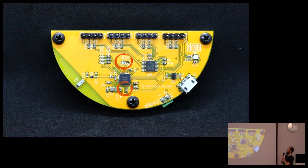I was very confused, and it took me a long time to figure it out, but basically, this microcontroller has an option to have a built-in DC-DC converter for power. So when it does Bluetooth transmission, they can usually lower the power consumption quite a bit by using a built-in DC-DC. But that requires some external inductors that I didn't put in, which is okay unless it thinks those inductors are there and tries to use them.